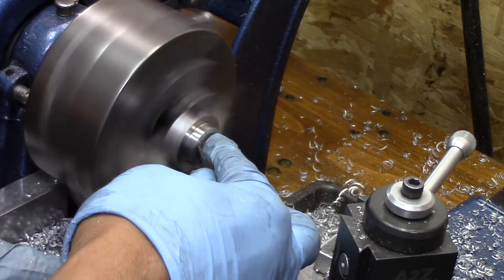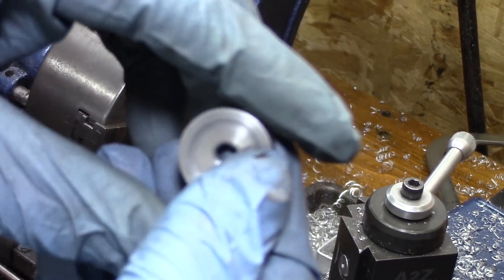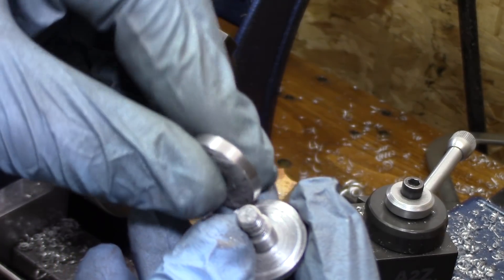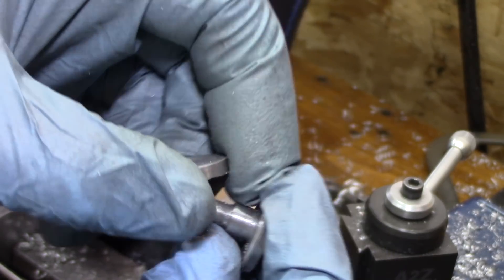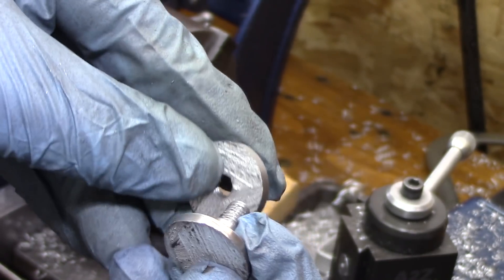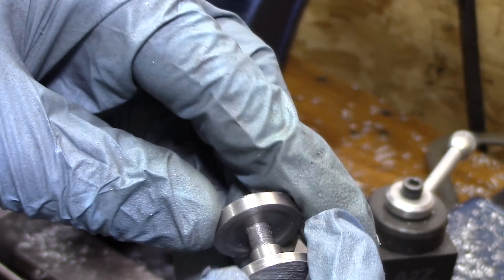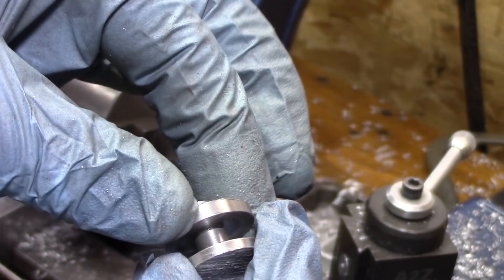After these get cut off, I figure out how to machine the rough-cut parts. I stuck the parts back in, got them indicated close on the six-jaw, and faced them. Then to cut off the end, I put a bearing in it, stuck it back in the six-jaw, and was able to machine the three pieces together to make it nice and flush.